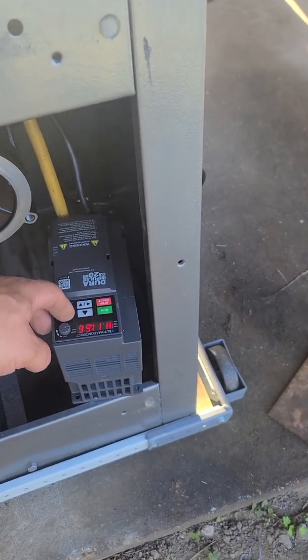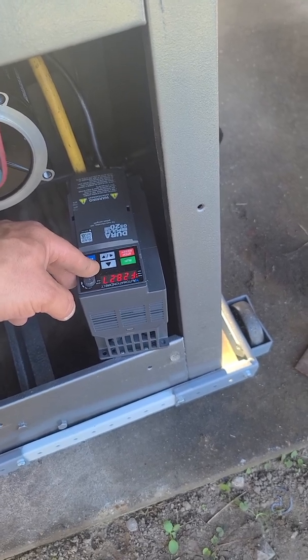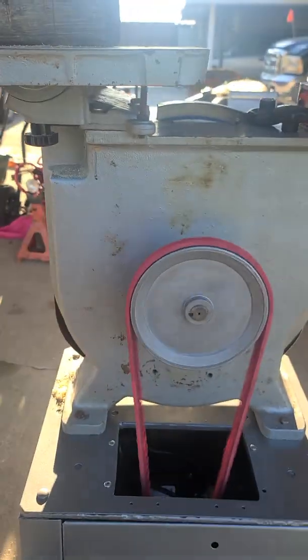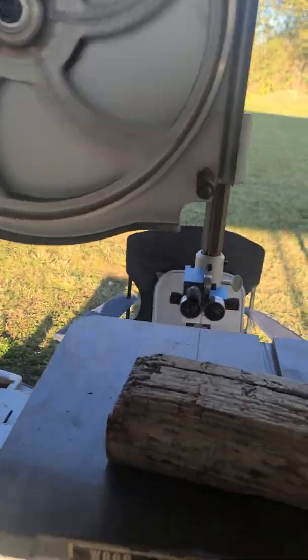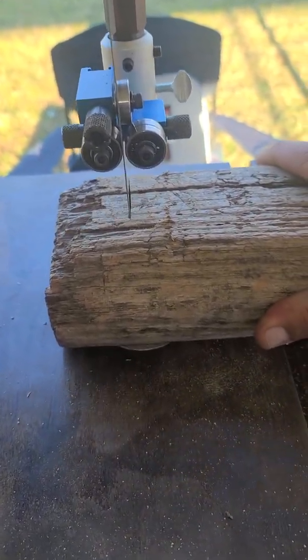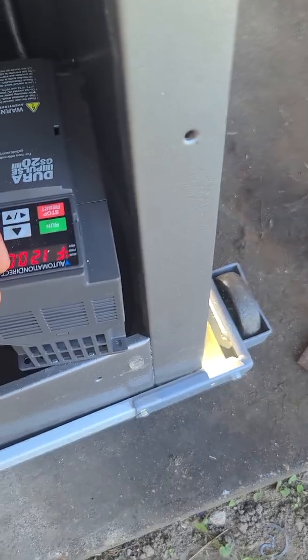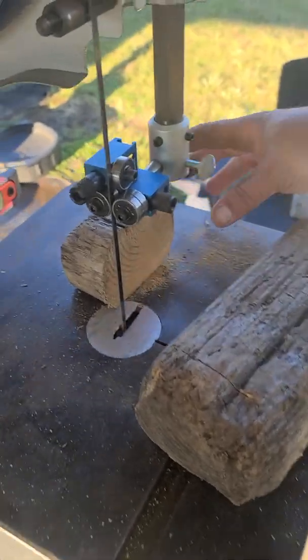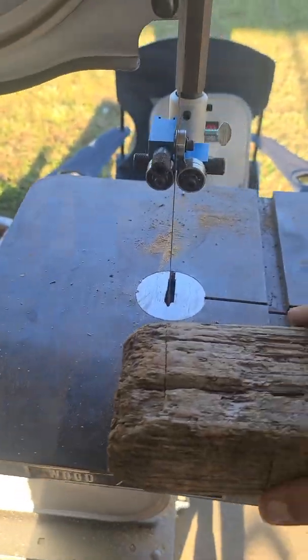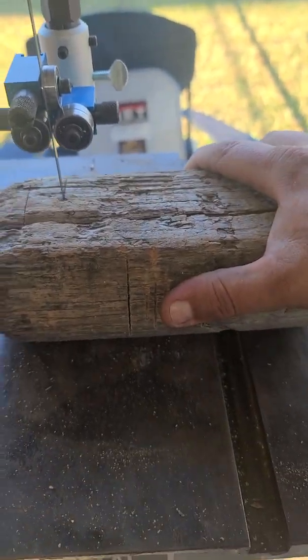Let's turn this sucker up. It's about quarter speed. A lot faster — the video is making it look like it's going in reverse. That's maybe 600 feet per minute. I think this can go up to 120 hertz because that's what the motor's rated at — it can go twice the speed. It's an 1800 RPM motor. Here's the maximum speed — cuts like nothing, like butter.